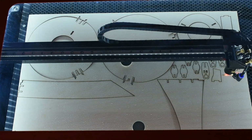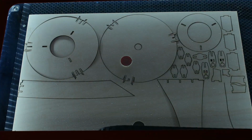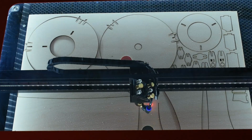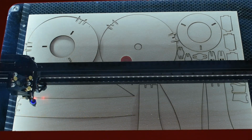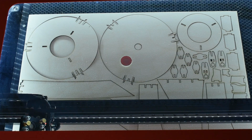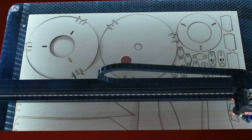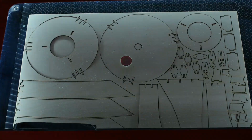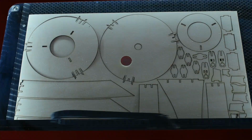Plywood is made of glued sheets of wood perpendicular to each other, but because 1/8 inch plywood is so thin, mine and likely yours are only 3 sheets thick. Because it is an odd number, this means that one direction is going to be much more rigid than the other, and because this design is close to the limits of what 1/8 inch plywood can support, you want to make sure that the rigid side is in line with the height of the tower.